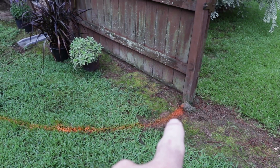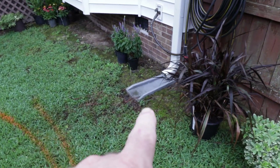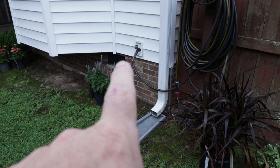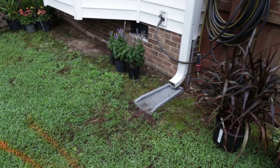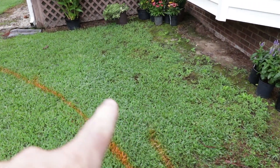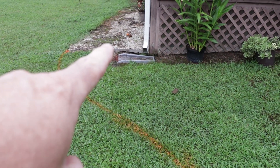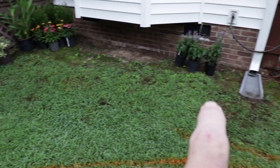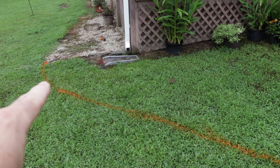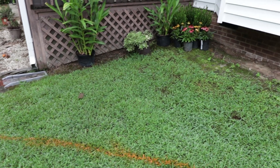Here's where this gate opens up and I put this nice curve on the ground. There's one of the downspouts there and a water spigot here — it'd be nice to get one of those boxes to put the water hose in. You can see the amount of turf that's got to be removed. This is only 120 square feet, so it's not too bad. This line is going to end right where this gravel is, and I'm going to dig from one gutter across to the other, tie them together, and dump the water out here where there's quite a bit of fall from the house.